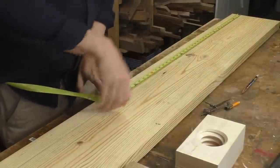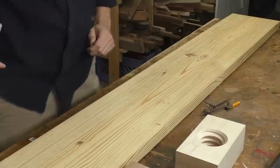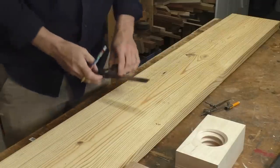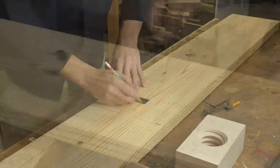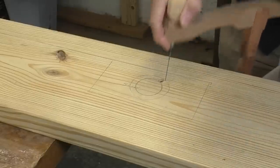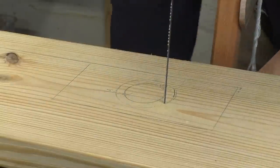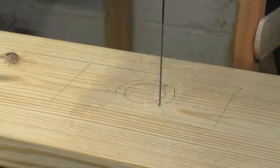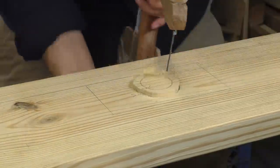I use a compass to widen the traced location into a clearance hole. Once you have one location, you can measure over and lay out the other one. It really pays to take your time here — between the nuts, the apron holes, and the holes in the jaw, you've got a lot of things that need to line up. Once you're sure of the layout, you can drill a hole and thread the blade of a turning saw right through. This is my DIY turning saw, and it's made to handle much tighter curves than this one. Running around this big circle is fast and easy, and the waste pops right out.